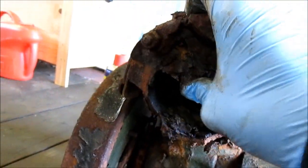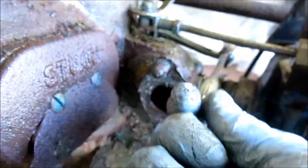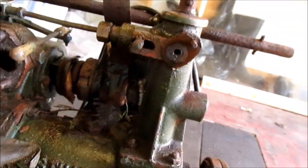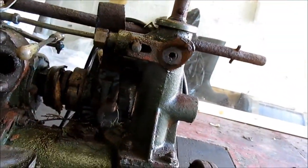The engine is literally — you could say it's literally falling apart, but we don't want to go that far because I hope it doesn't completely fall apart. It's the best part of knackered. You can even see the piston in there. I got the carburetor off — that's kind of free, just needs a little bit of work. The main job is to get all the accessories off; I want to get the magneto off, test the coil, and see what the problem is — probably going to be open circuit. I'm expecting the worst — a complete new rebuild of the mag or whatever.